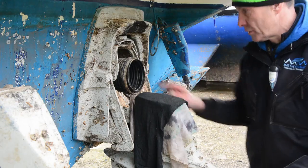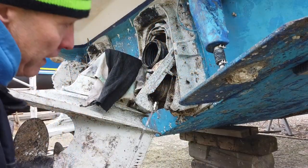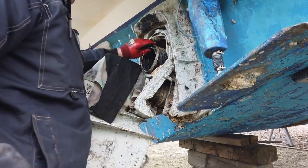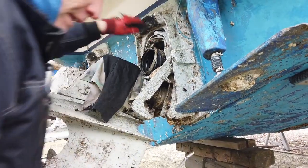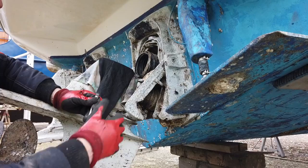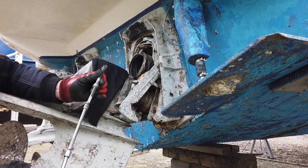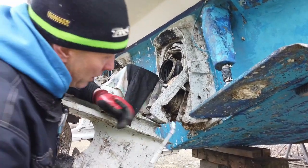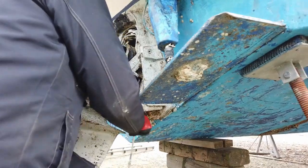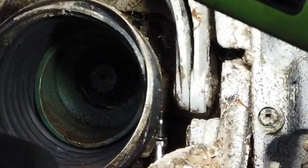We can remove that, so we've got to get inside there and get the other inside bolt off. Remove the inside UJ clamp now. Unfortunately, there's no easy way of doing this. There are flexible screwdrivers on the market. There are all different ways, long screwdrivers. The clamp is stuck right at the back. I use a quarter drive kit with a universal joint on it. And obviously, what you're going to do is make your way up there and try and get at this clip. Get on there and undo it.